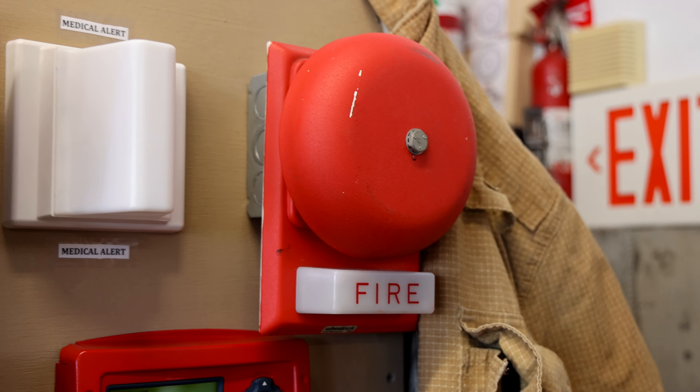To the left I have two smoke detectors. The one on the left is a Bosch F220-P, which is a photoelectric detector, and the one on the right is an Edwards EC10U-3, which is an ionization detector. I'm going to spray some canned smoke at both of them later in the video and we'll see which detector activates first.